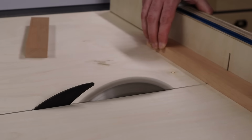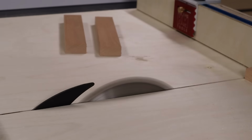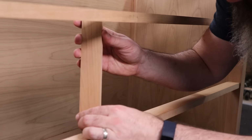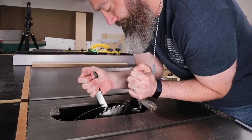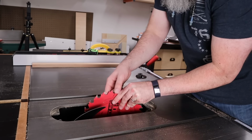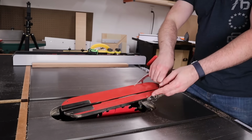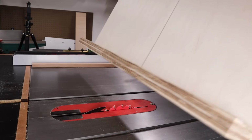When cutting dividers, this is another time that you want to cut things slightly oversized and sneak up on the perfect fit to fit within your dado. Once the size is perfect, then you can cut the tenons to fit the dados. For this, you want to make sure you're using a flat grind blade to get a nice square shoulder on the tenon.